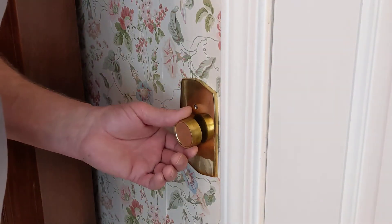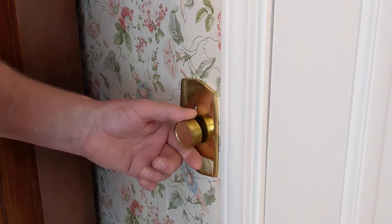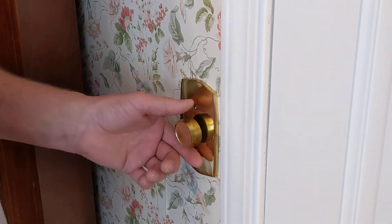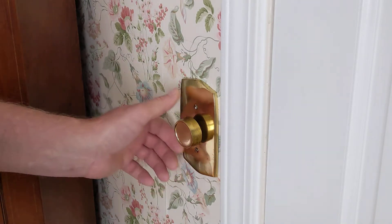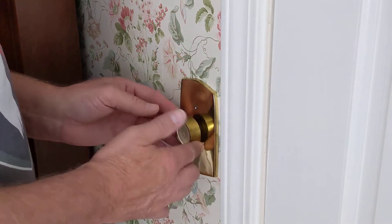The first thing we're going to do is turn the lights all the way up. I've got somebody in the other room who's going to be flipping breakers and we'll see which breaker turns the lights off. We've killed the power and I want to go ahead and remove this old dimmer.